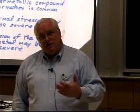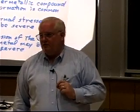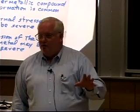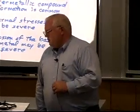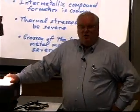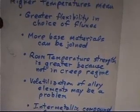And it turns out in some of these brazing of ceramics, you actually need a little bit of oxygen in your atmosphere. Not too much, or you'll just oxidize the metal and it won't flow, but a little bit of oxygen will help form some of these oxides that help the wetting at the interface. So virtually any metal can be brazed in many of our ceramics. There are some ceramics that cannot be brazed.